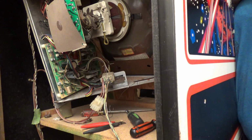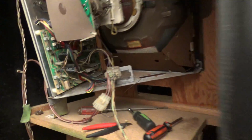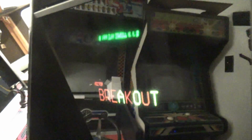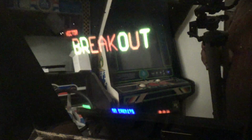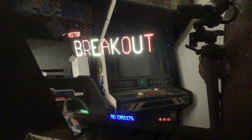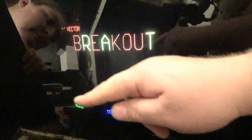I'm going to turn the brightness up, the flyback up. Alright, good. See anything? Yep, and it's fuzzy, turn it down. Okay. Down more. Down more. Right there is good. And it's fuzzy. It's fuzzy? Yeah. Okay, hold on. Okay. Yes, it's fuzzy. Adjust the focus. You're way out. Right there, dead on. Okay. Beautiful.